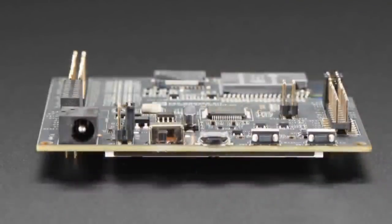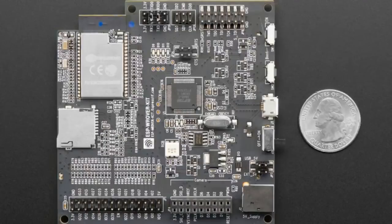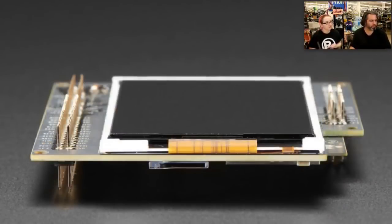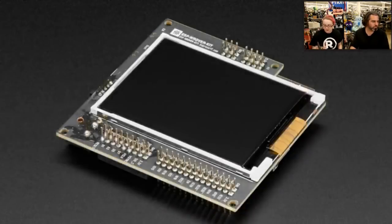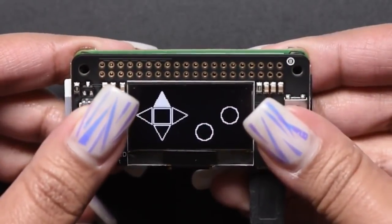Next up, this is an update but it's a pretty big one — the ESP32 starter module kit. It's the ESP32 starter board from Espressif, the board their example code uses. This board has been updated: it's pretty much the same except now instead of the original ESP32 it has the WROVER module, which includes an extra four megabytes of PSRAM. It's a little bit bigger because of that extra chip, but you can buffer more memory. It also has a display on the back, an SD card, a JTAG interface, pinouts, power supply — all the goodies.